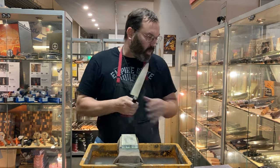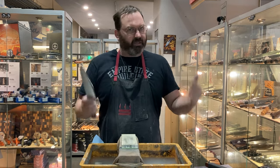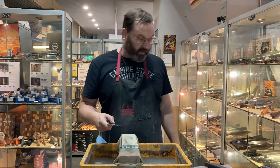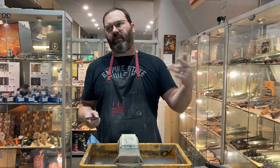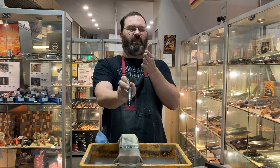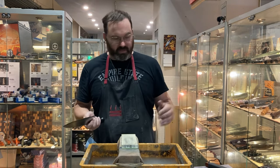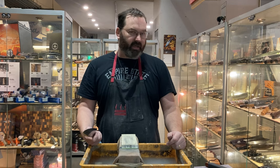And that's it guys. So again, what are my points? You're not keeping your angle consistent — that's number one. You're going to be rolling it up and rolling it back, that's just what you do. Try to come to the end very slowly and make sure this hand is like a jig, and you're the machine. Adjust it to the angle you want, lock it down. Not getting a burr — go to a coarser stone and get your burr; don't spend all your time on a thousand grit. Go down to 200 or 320 if needed. Bad profile — check your profile, see if it's straight. If the knife is bent, chances are the edge might be out of profile. And dished out stones — flatten your stones. That's number one. Thanks for watching guys — hit the like button, subscribe to our channel, check out our website for great knives and super sweet deals, and we'll try to keep the cool content coming. Thank you.